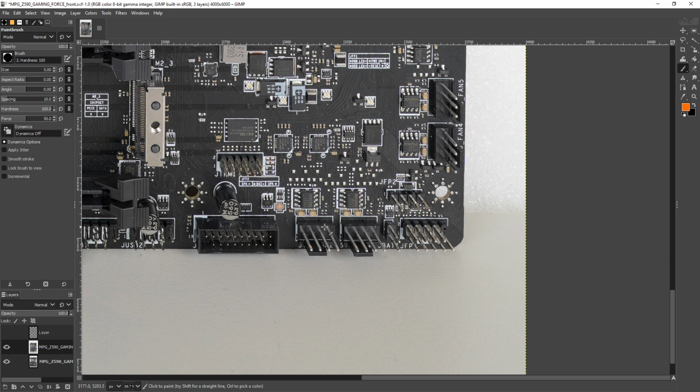So on those motherboards, I really want to have a safe boot button because it makes life so much easier. But MSI boards are generally really aggressive on their auto recovery. If you punch in settings that don't work, the board will give up on them pretty quickly, in one or two boots. You can actually adjust how many times the board will try to boot your settings, but if you leave it on auto, it'll try it 1 or 2 to 3 times. And also on Intel, it does this very quickly. And then it'll just throw you back into the BIOS with all your settings still there.